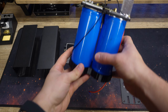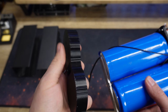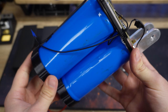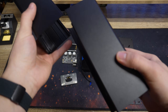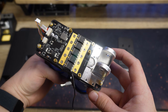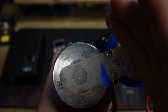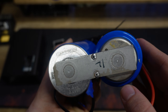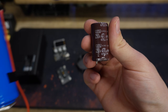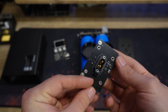With everything fully disassembled, we can see that this is a pretty simple device. It's built very well, but I found a couple of 3D printed parts inside, which is a little funny. If these were 3D printed from ABS filament — which I think they are — the plastics are completely identical to injection molded parts, so I wouldn't really worry about it. The outside enclosure is what matters and it's built right, so the build quality is fine by me. On the front of the welder we have a separate PCB which handles the logic; underneath we have a beefy power PCB with the switching MOSFETs. And let's just appreciate the size of these supercapacitors — they are huge. I saw a 3Wh rating and since these are 3V caps, the capacity should be around 2400F. On the back of the unit we have a PCB which holds the XT60 connector for fast charging.